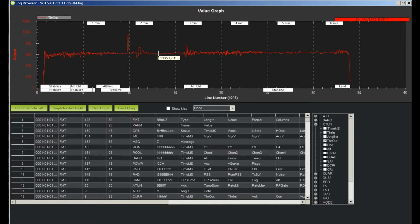So that's why we set this mid-throttle parameter. Now, while it's in altitude hold, loiter mode, if you push the throttle up, it will nudge the platform up. If you push the throttle below 50%, it will nudge the platform down. Now, if you are in altitude hold and you move the throttle up to 3/4 and the platform slowly drifts up, don't expect that when you go into stabilize mode, you nudge it up to 3/4, it's liable to zoom up, because this parameter is for making sure that it doesn't go wild if something goes wrong.